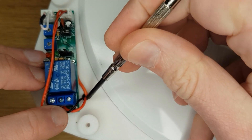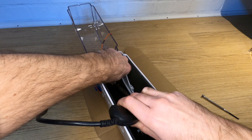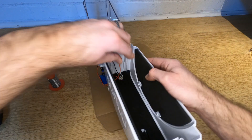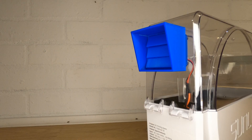Run the black wire from the power connector through the hole so it can reach the box power plug — you may need to extend this if the wire isn't long enough. Solder both the board power negative and the fan negative directly to the negative pin on the main power plug. Run the fan positive through the inside of the box and out of the hole to the ON terminal on the relay. Now everything is connected — the relay board will only have power when the thermal switch is heated above its switching temperature, and the fan will only receive power when the timer relay allows it.